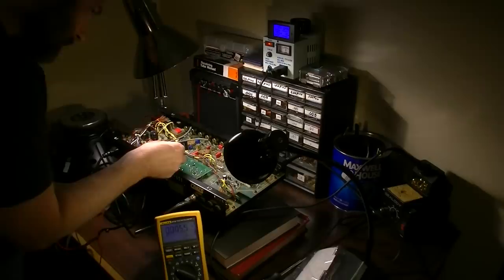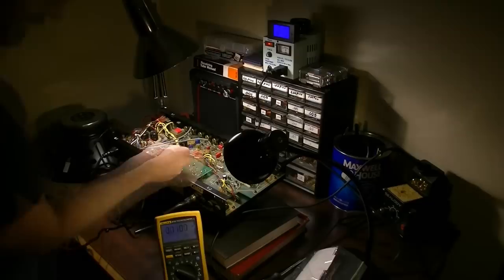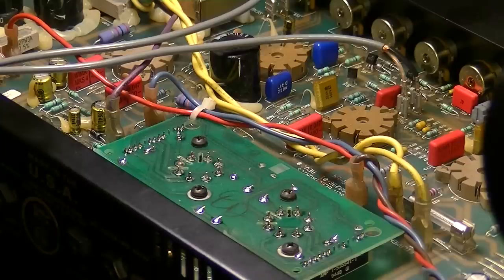That one's negative, so that's probably the grid. Oh, maybe not. That one's negative also. We've got our high voltage on our plate and also on our screen on both sides. So it's not a question of the voltage. We've got just a really hot tube on this one side and a really ice cold tube